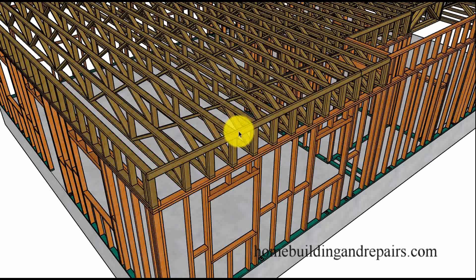And then of course our supporting board here. This is going to help with our perimeter nailing and provide us with a method to keep all of these joists nice and straight. This is a common method — having a 2x4 brace here for this type of flooring, especially when you're dealing with 22 inch tall floor joists.